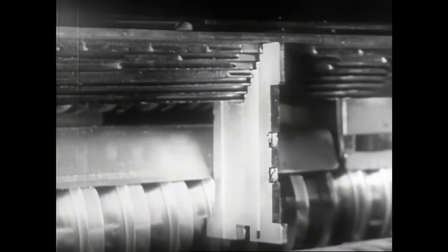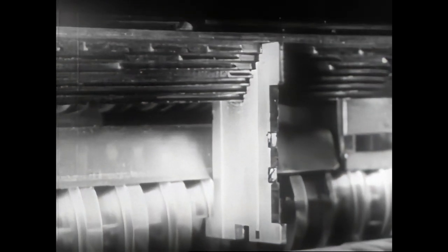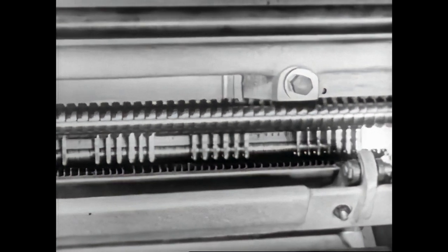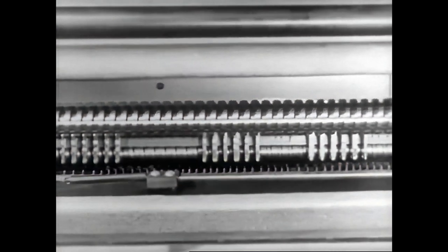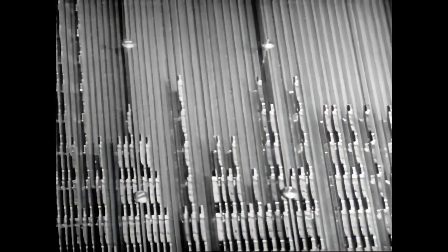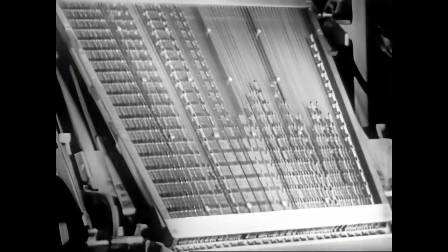When the distributor bar fails to supply the required combination, the mat, no longer having support, drops into the magazine. Therefore, for the 90 magazine channels, there are 90 different tooth combinations, and consequently, an equal number of combinations along the length of the distributor bar. The mats, detaching themselves from the bar, return to their respective channels in the magazine.